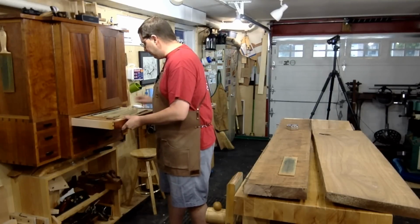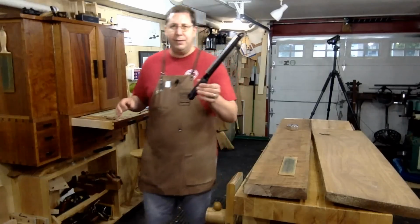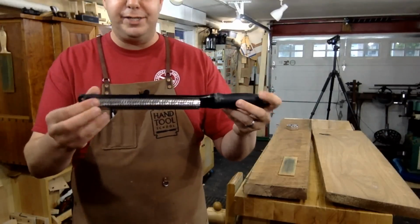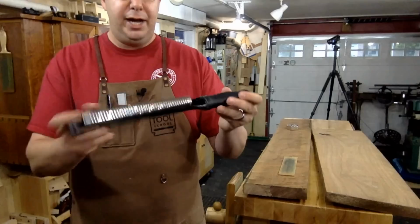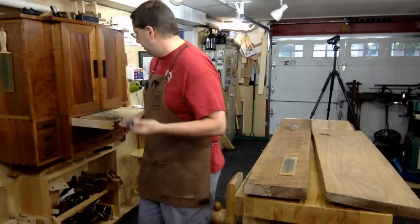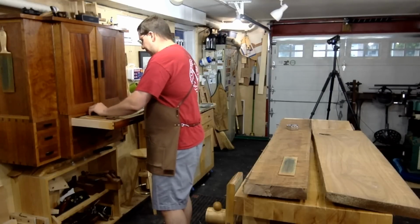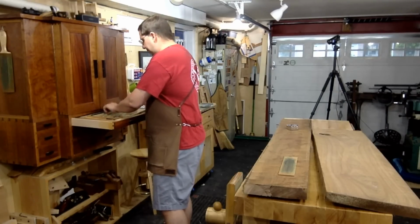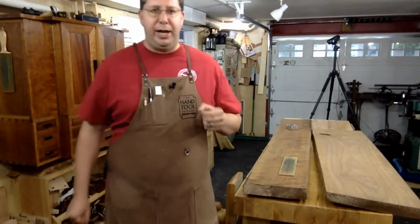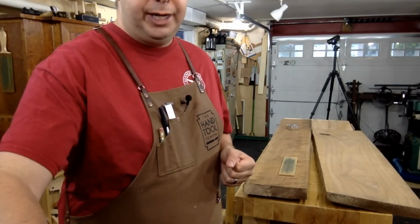The only other thing that I use that's kind of fun is this microplane thing. I got this at Woodcraft. If you've got a lot of heavy removal to do, these are impulse hardened teeth. And again, they're making little shavings. You can snap a round profile and a square profile into this ugly plastic looking thing, but you know, it is what it is. It's a cool tool. It works really well when you've got a heck of a lot of wood to remove. If anybody can think of what that other brand of machine stitched rasp was, let me know. I can't remember now.